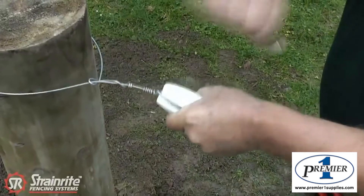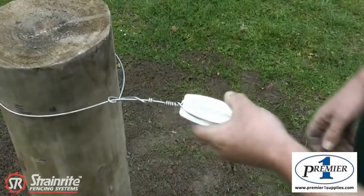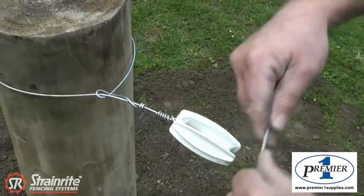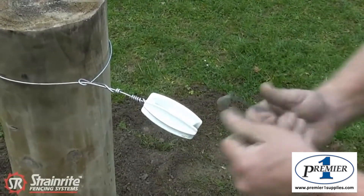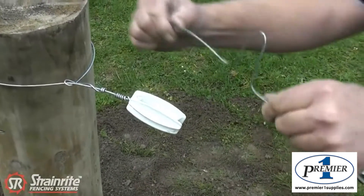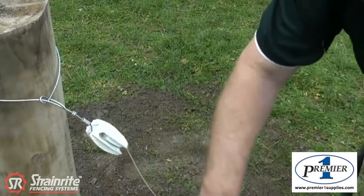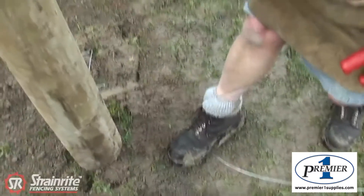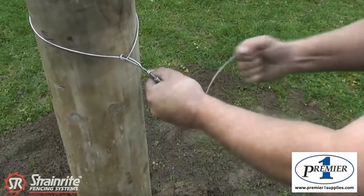Just bring the wire over and get a nice clean break — you don't want the insulator too far out from the post. For putting the other wire in, do what we call a Mexican hat. Bend the wire the way it wants to bend. Measure from about the middle of the hole to the front of the insulator, put a bend in it on the corresponding side so you get what we call a Mexican hat — that makes it easy to get it centred. To hold the wire nice and tight, you can step over it, put the wire over your foot and under your foot and lean back. Now that wire is going to cross where we bent it, so it's pulling off the middle. Hold it and do your six tight loops.